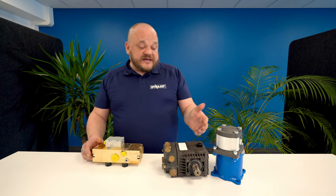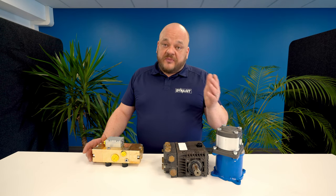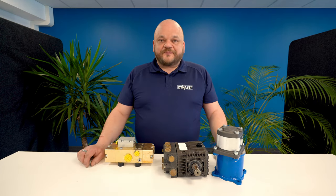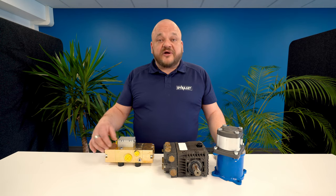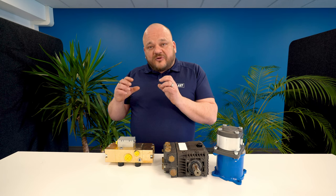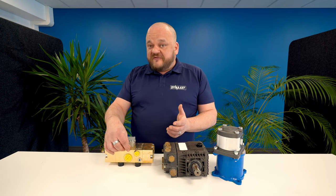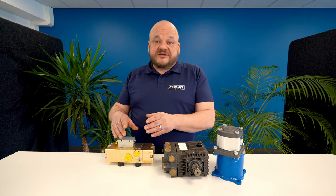A triplex pump has a separate mechanical part with separate lubrication oil, which is one maintenance point more, and also the pump has to maintain a certain level for the lubrication to work properly. The HPW pump has the hydraulic piston integrated inside the pump structure, making the pump really compact. As the pump is really compact, a great part of the heat generated in the hydraulic piston is absorbed by the pumping fluid, which is normally water, and so the heat load for the machine hydraulic system is minimal.